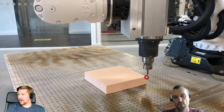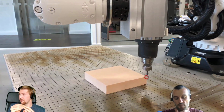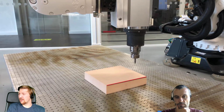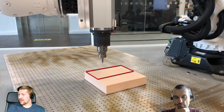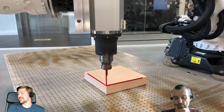So you've got a point being the 0, 0, 0 coordinate system, the line, which doesn't need to be, but is normally your X, and then your plane gives you effectively the axis of the Z. So you can constrain all of those 6 degrees of freedom, X, Y, Z, A, B, C, with 3 features: plane, line, point. This looks exactly the same to me.